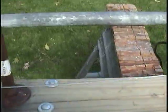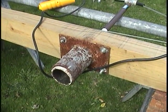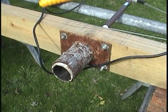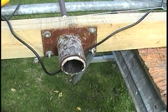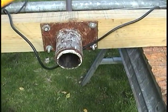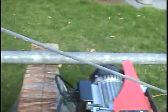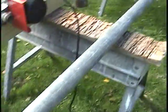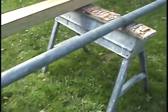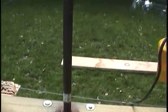For the center post bearing point, I used an old cut off from a pipe column. I'm the kind of guy — like a lot of guys that watch YouTube videos and work around construction — that saves little bits and pieces in the off chance that someday you can find a home for them. So this found a home in the bottom of my crane. I used PVC pipe and some sheet metal to fit the column, which is a piece of schedule 40 galvanized pipe. It's a fairly heavy piece of pipe, salvaged from a job — a vent stack that I cut off and stuck in the backyard.